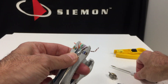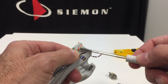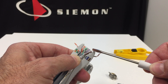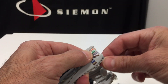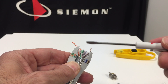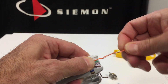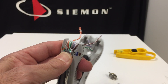As far as the pair on twist, in some cases I have the pair twist pretty high here. That should still work fine. It's okay to have no twist like this brown one — you're still well within the recommended distance for your first twist. With a bigger cable, if you're using 22 gauge, I probably wouldn't recommend having that first twist so high. In that case, you may want to untwist one more time and lace in like this. That'll make termination a little easier.